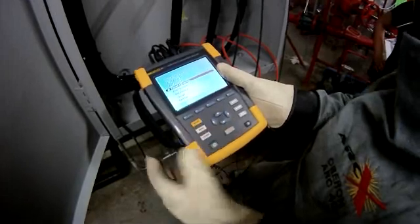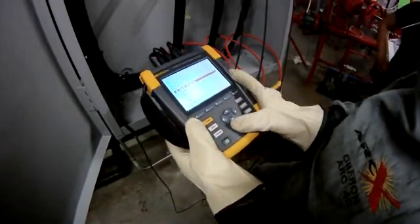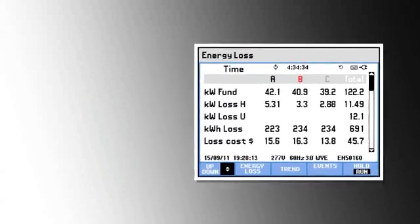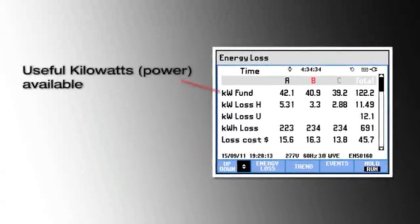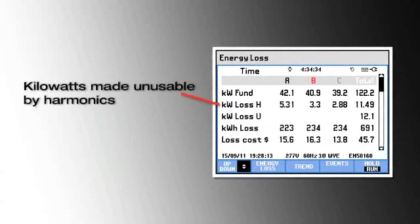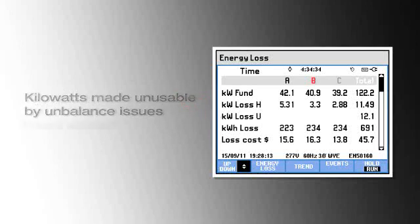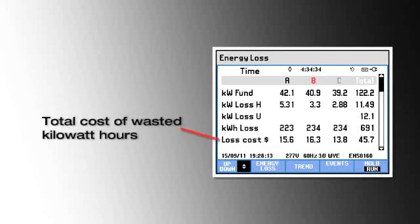This is what I wanted to see. This is the new unified power reading that our engineers were telling me about. They said this new feature quantifies the energy waste caused by harmonics or unbalance — not just measures it, but actually calculates how much energy is made unusable because of harmonic distortion. And I could input my utility rate into this, and it would tell me in dollars how much energy we're wasting.